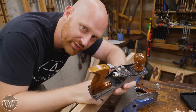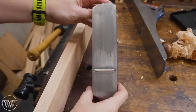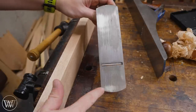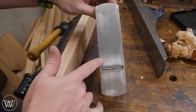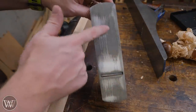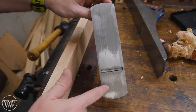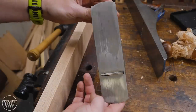Case in point: this Harbor Freight number 3 trash plane. This was not flat and I was not able to get a good shaving, and I was actually wanting to use it in a plane shaving competition. So for this one I flattened it. You can see I'm getting scratches here at the nose, right in front of the mouth, and behind the mouth — everything else is a valley where it's lower, and that's perfectly fine. This is flat enough to produce half a thousandth shavings.